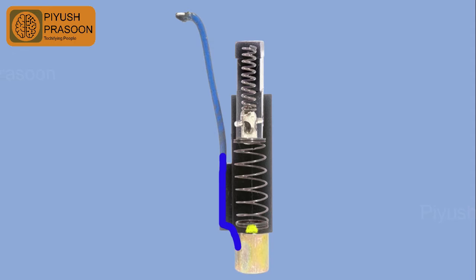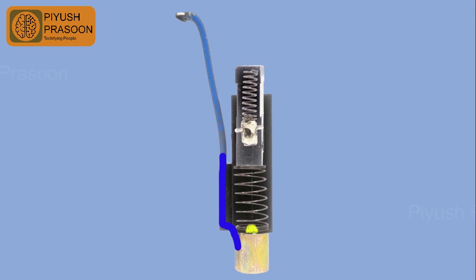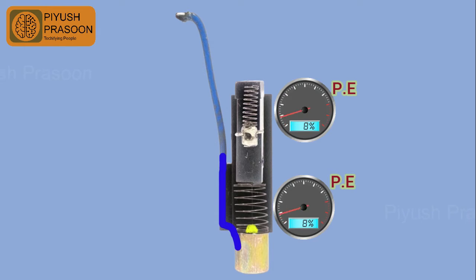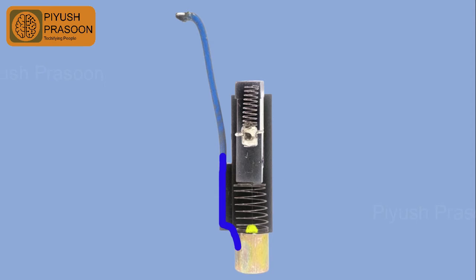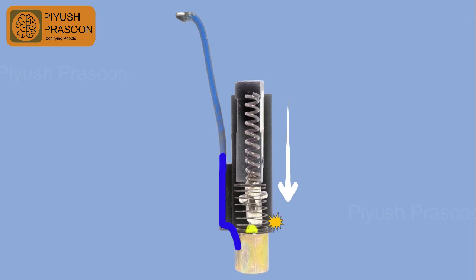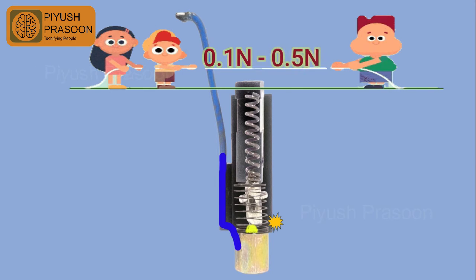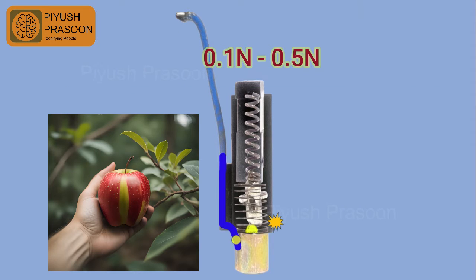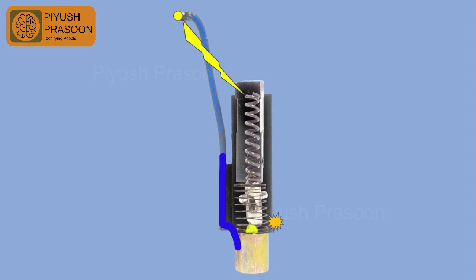Now the time to see things in action. As soon as the user starts pressing the push button, both springs begin contracting, resulting in the storage of a high amount of potential energy. Once the push button is about to reach the end, the push button spring suddenly releases and expands all at once, converting the potential energy into kinetic energy, which accelerates the hammer to hit the piezo crystal with approximately 0.1 to 0.5 newtons of force — the same amount of force you apply with your finger to check the firmness of an apple. With this force, 800 volts are generated.